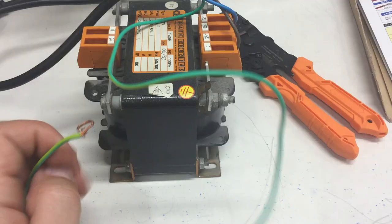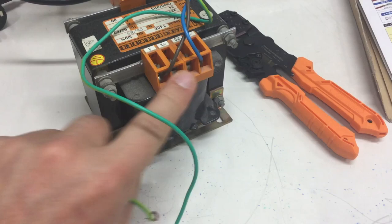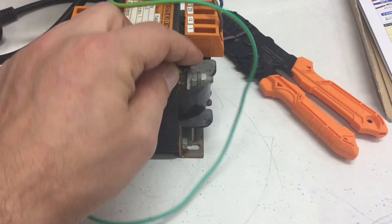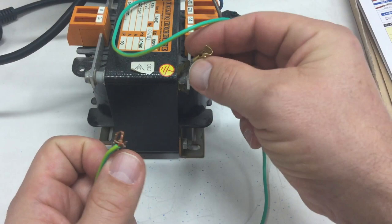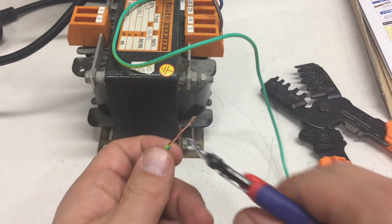Let's test it. I've been using this transformer directly on my bench — nicely shielded mains AC in, and the mains AC cable with mains earth. I usually just clamp the wire around the quick connect, but that's of course not a viable solution. The proper solution is to crimp it onto a correct quick connect and then slide it on. Let's see how that huge Engineer works.